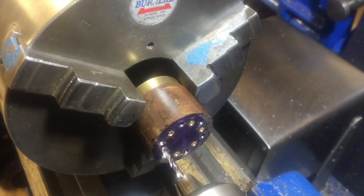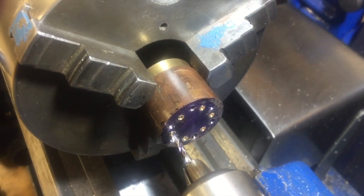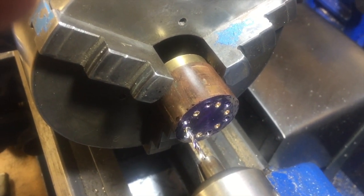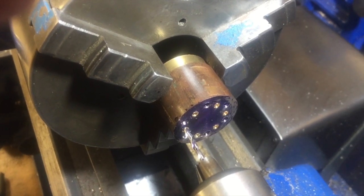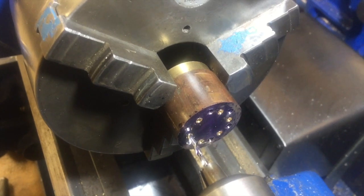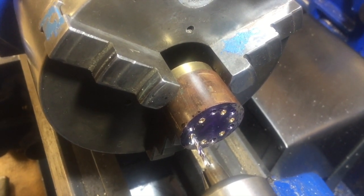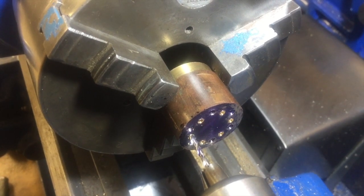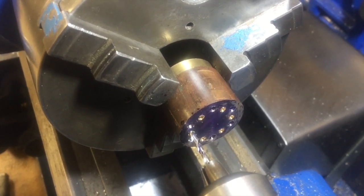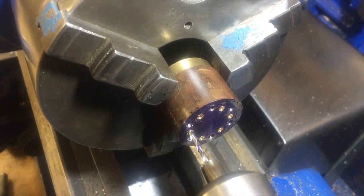What I've done is made six holes initially based on the corners of the hexagon I wanted. Then I drew a line between two of the holes, which gave me the position of the innermost hole — one halfway along a flat. I turned it along two clicks to get to that position and positioned the drill at that point, at the lowest point of the flat.